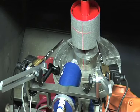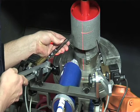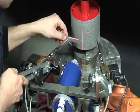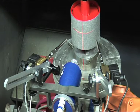Using a laser beam or metal rod will further simplify the adjustment process. The nozzles can be set via the flexible holders in such a way that their distance from the component and the flame is 40 to 70mm.